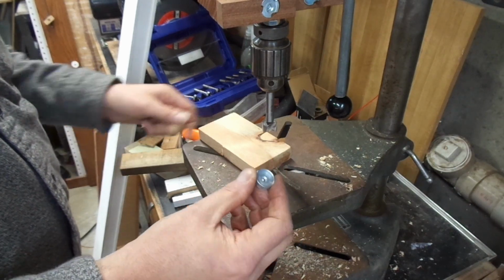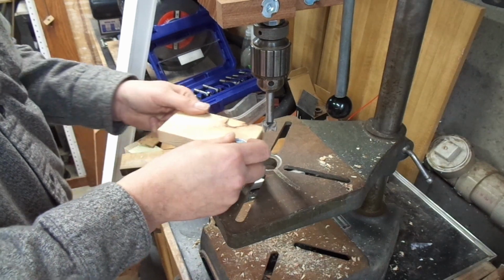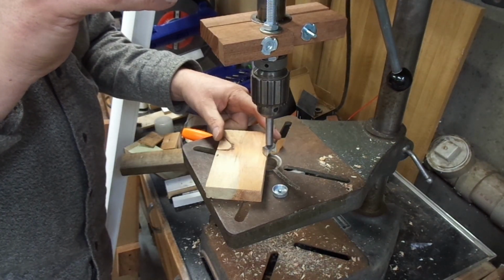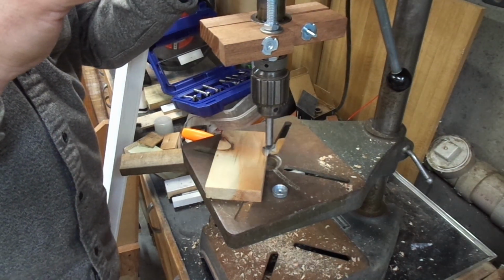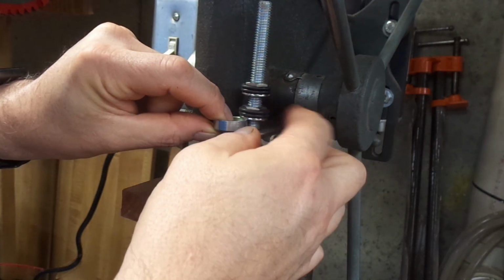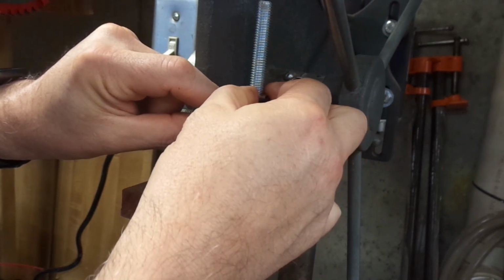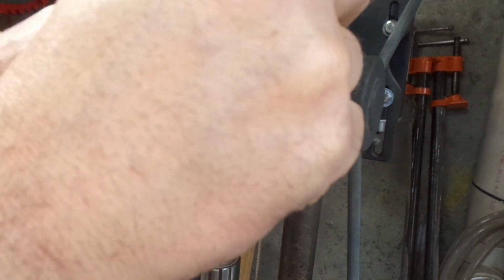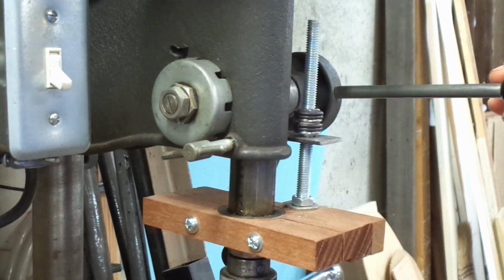So here's a steel cup that goes on a magnet, and maybe you would want to sink that into a piece of wood. So you start as you engage the flat of the Forstner bit against the block, and now I'm going to lock that in place. You can use the cup washer as a guide. Put it up here, lower this bolt till it engages it, and then lower the locking nut onto that nut. And now when you release the quill, it can only go down as much depth as this cup washer allows.